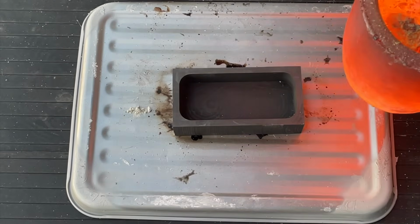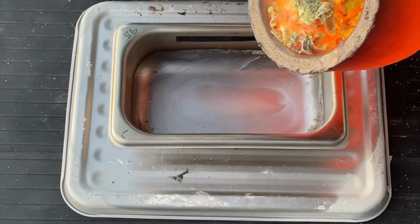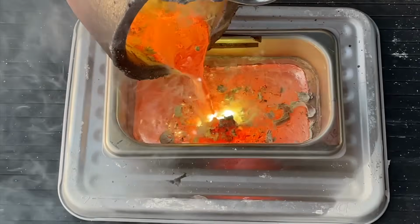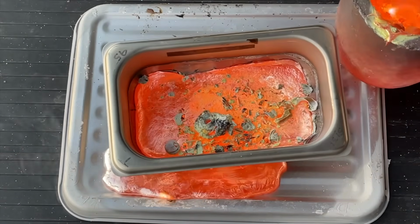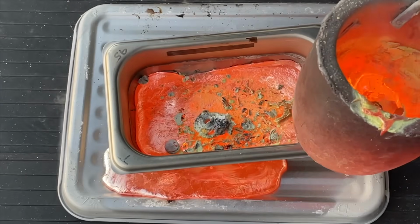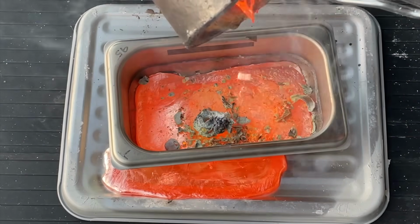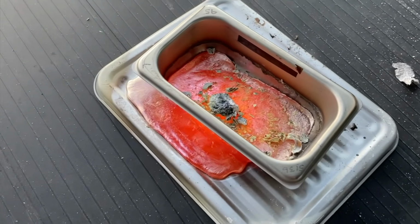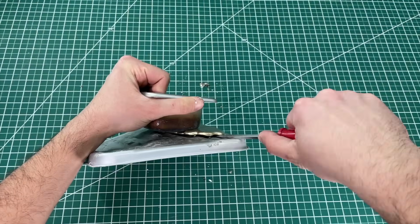So we originally decided to use the graphite mold, but last minute changed our mind. As it turns out, that was a terrible mistake on our end. Apparently our brass was so hot that it melted the stainless steel. I still can't explain this one to you, but please take our mistake as an opportunity to learn to use a thicker container and have a tray or something underneath as protection. Our aluminum tray luckily saved our floors and helped prevent a disaster. Once it cooled, we attempted to extract the brass, but it was in there for good.